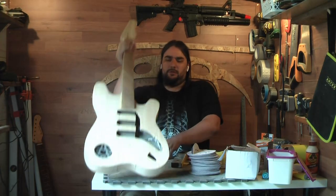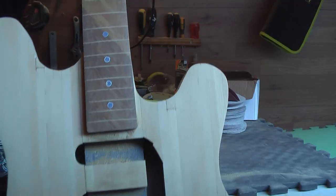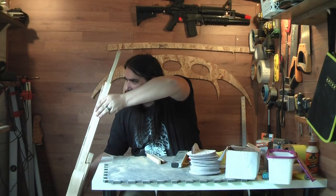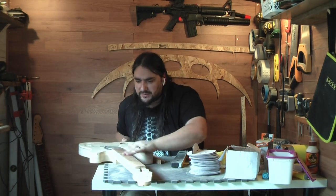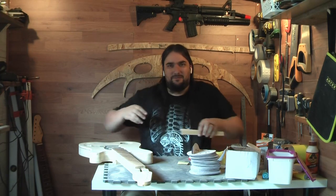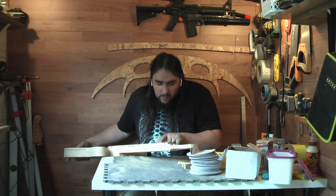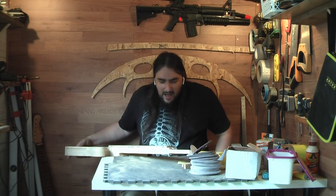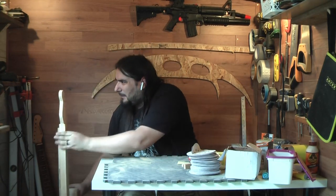And there we have it. I did actually find some 320 in that pile, so that is now done to 320, and I am very, very happy with that — it's got a nice sheen to it. It looks great. The only job is these inlays where I've been sanding the living hell out of it. There were little bubbles in the resin — it's designed for gluing stuff together rather than being used the way I've done it, so I kind of figured it might bubble up. So I'm going to try and dig all of the sawdust out of here. I kind of like it — it almost looks like a marbled effect. I'm going to dig as much sawdust out and then fill it up with superglue, and then that's all done.